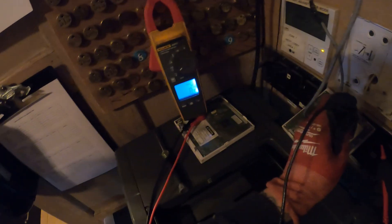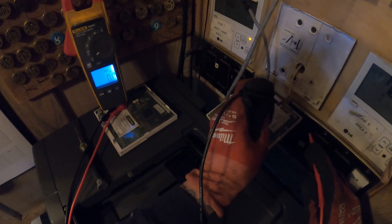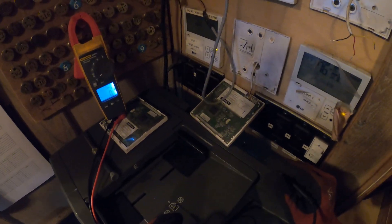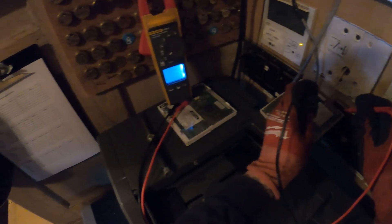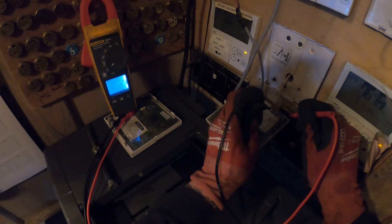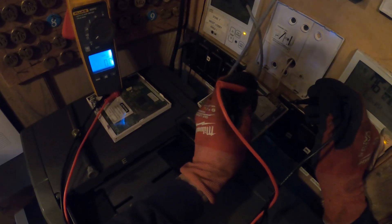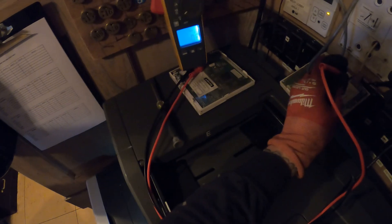Let's check here from ground — got 8 volts on that one, got 8 volts on that one. Got nothing. Is it my leads? I don't think so. Nope. Let's check across — that's already not getting voltage. We got voltage at the unit but not here. Let's check between any two — supposed to get 12 volts. Nothing on that one. Nothing. Nothing.